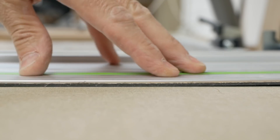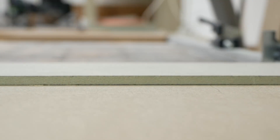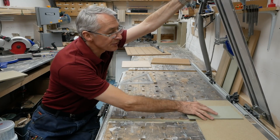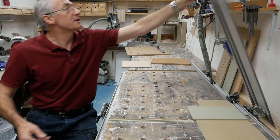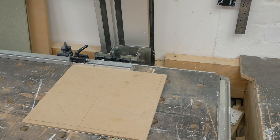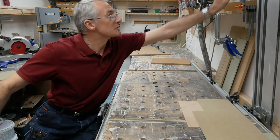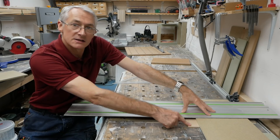Now for a cut like this where you're using thinner material than the fence is set for, all I do is use a little piece of scrap to go under the rail to pack that out. If it bothers you that the splinter guard isn't touching the workpiece, you can either bring the scrap out so it effectively becomes the splinter guard — you cut through that scrap piece to get to the workpiece — or you do it the other way around and put your scrap underneath, so it's supported at all times, and you get the perfect cut with the splinter guard above and protected by the offcuts of scrap wood underneath.